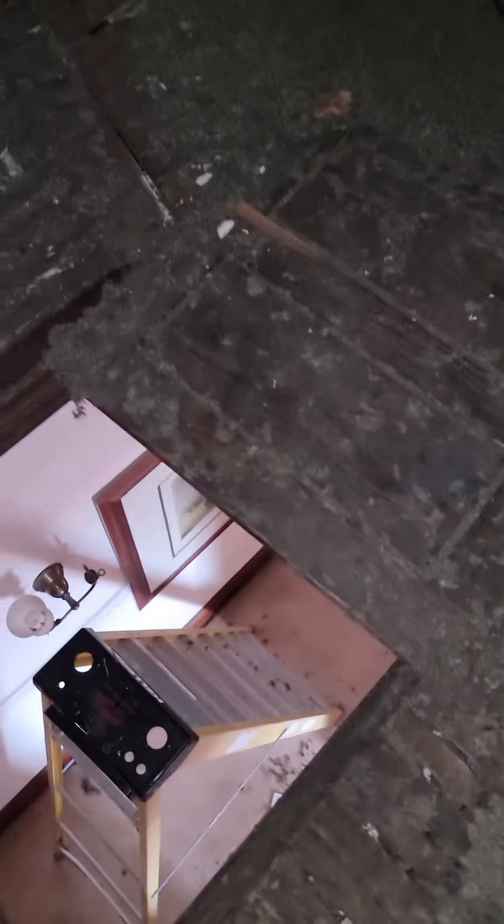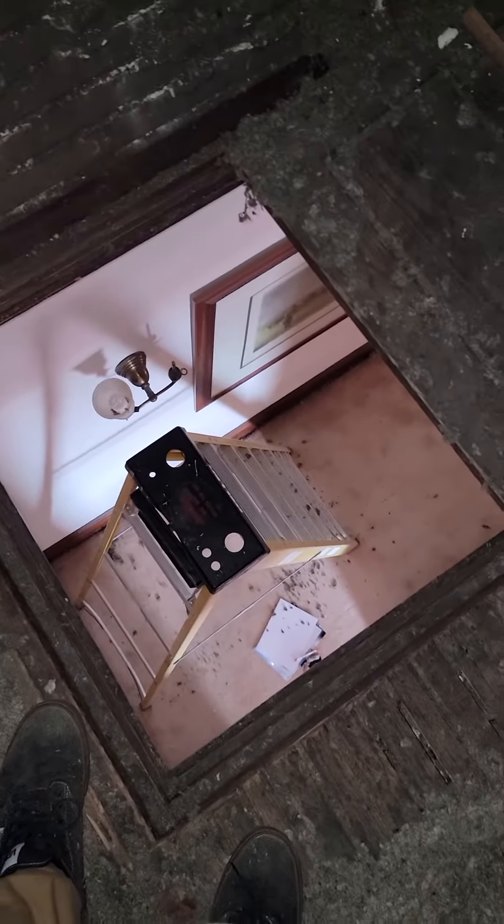The flush lines need to hang from the joists at the end. It's all plaster — falling apart plaster all around. I'm not going to recommend cutting for stairs, but I guess we could. You're talking about cutting out a lot of prep plaster in a 104-year-old house with tube running everywhere. So because the opening is large enough, we'd work off the ladder. I don't know if the stairs are generally going to be an option here. So that should be everything.